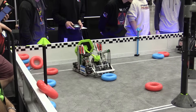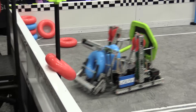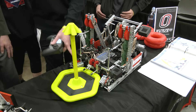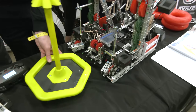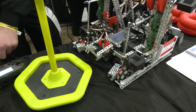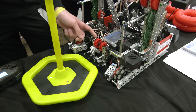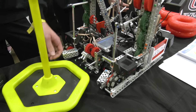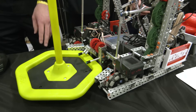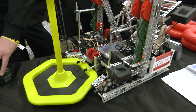Let's pass over to Aaron and talk about this MOGO clamp. This whole process is just super cool. So here we have our clamp — it's a two-motor clamp and first it clamps the goal and then it tips, all in one motion. How it works is when the motors spin, the clamp lowers until it hits the goal and stops. Since the entire clamp is mounted on the axle and the motors are still spinning, the entire system rotates.